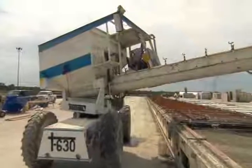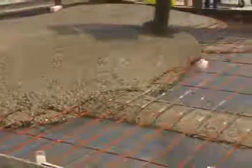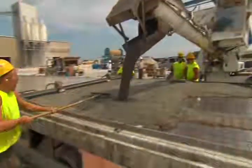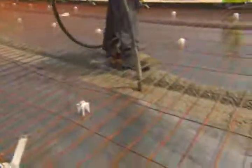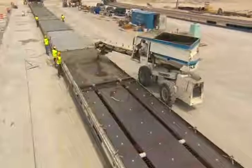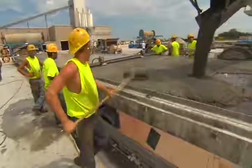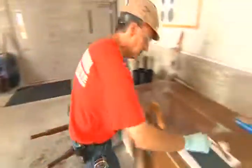These vehicles are called tuckers, and they are used to deliver the concrete to the bed in the yard. A self-consolidating concrete is being used to cast these particular double T's. With this type of concrete, vibration is not required to consolidate the concrete. However, minor controlled vibration is used in the double T stems to help remove air from the sides of the form, reducing bug holes in the stems. We do use self-consolidating concrete for our double T's — we feel that it gives us a better finish, it's easier to place, and it takes less labor and less strain on the labor to place that concrete.